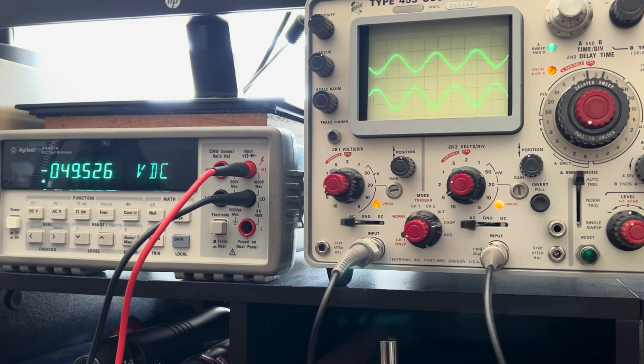What else are you getting? The big delay, the swell back up into volume, the recovery delay after hitting your chords — which should not be perceptible. And you're getting a saggy distortion. Those are all indicative of that particular condition.